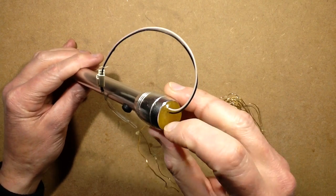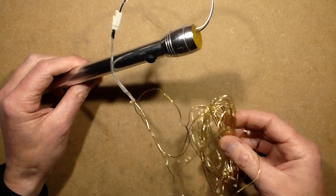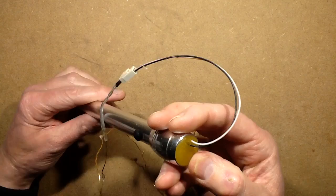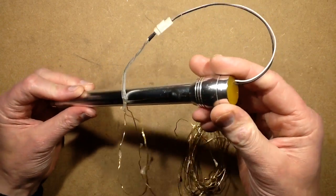And a resistor and a transistor, if I recall correctly, plus another resistor to limit the current to some LEDs connected via a connector. Just all potted in so that the resin protects it from moisture and also lets enough light through to be detected by the LDR — the cadmium sulphide photocell.